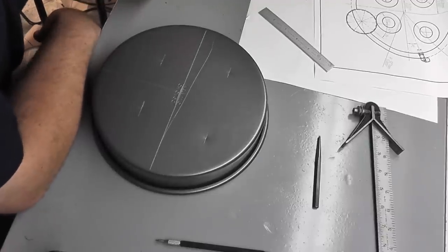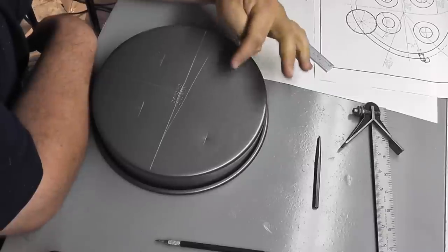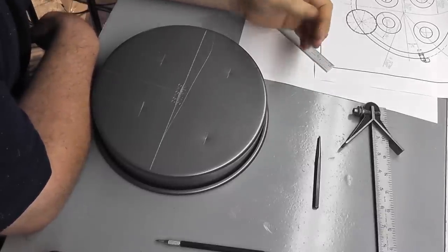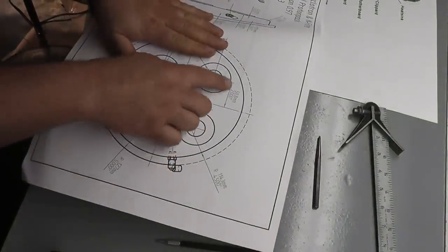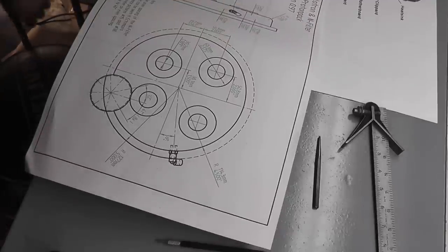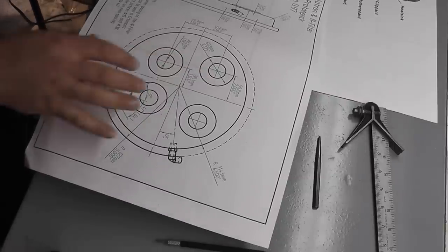All right, so I just checked out my van and the hole saw I have is dull as crap. So I'll get a nice new sharp one for this so we're not chewing up the metal here. But, you know, you get the gist of what we're doing. We have basically a nice little flange here, which I could probably make out of a piece of aluminum. I have some 3-inch aluminum here, I think, floating around in the shop. I can probably cut a couple of discs off and use that for this.